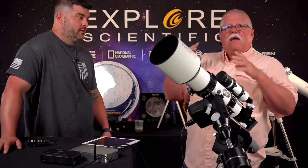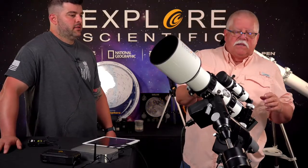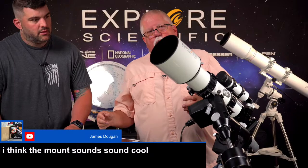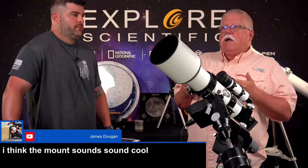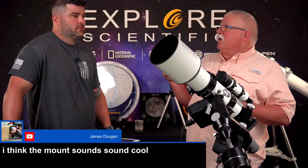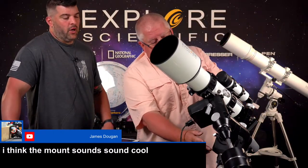It's 180 degrees. So now the round ring gear that has a tight side and a loose side, that loose side is now rotated to the top, and the mount's going to have flop, gear mesh, loose mesh, back and forth, wobble, wobble, wobble. And you're going to think you need to adjust the worm gear. And so you're going to figure out how to do it. And you're going to push the worm gear up. Yeah. If you keep doing the same thing, in four more nights, you've now bound it up because now it's turned all the way around. Agreed. To where the tight mesh was, and now it's so tight, it's super tight, and it won't work. Correct. So I'm going to put this back. No, leave it alone.